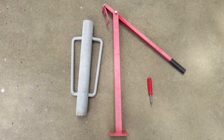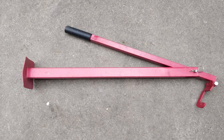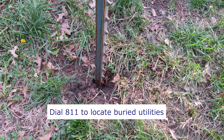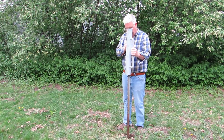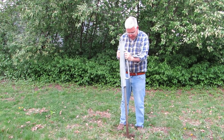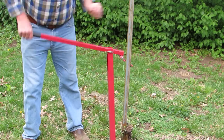Use the following tools to erect the telescoping pole. A post puller is useful for removing a post from the ground because you may want to move the nest box in the future. A flathead screwdriver is needed for tightening the hose clamp. Before you drive the T-post into the ground, dial 811 to locate underground cables — you do not want to damage them or yourself. Put the post pounder on the steel T-post and tilt the post at a slight angle in the direction that the nest box will face. This will make it easier for adults and young to climb up to the hole of the nest box. Carefully pound the post into the ground until the anchor plate is completely in the soil. If you need to move the mount, use a post puller to pull up the steel T-post.